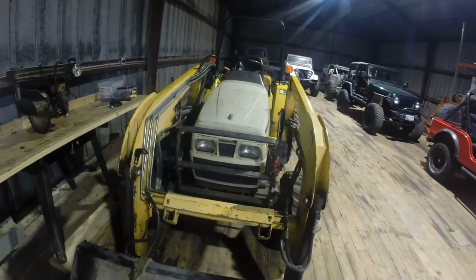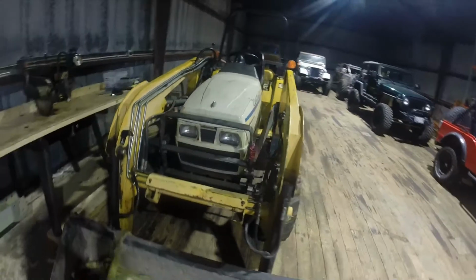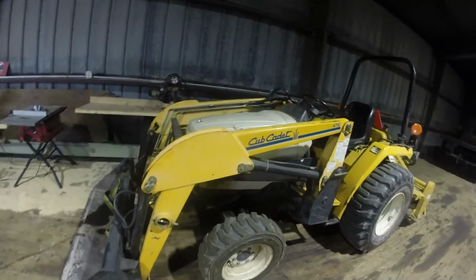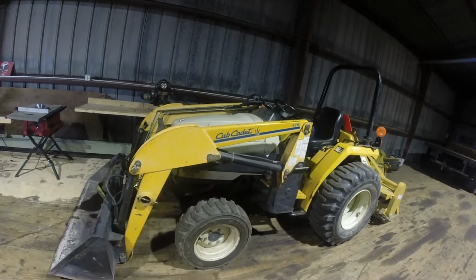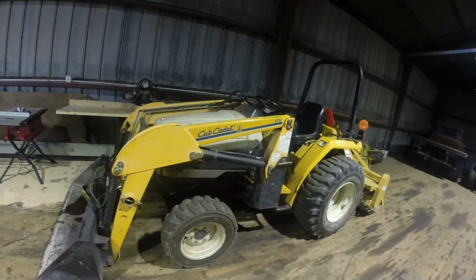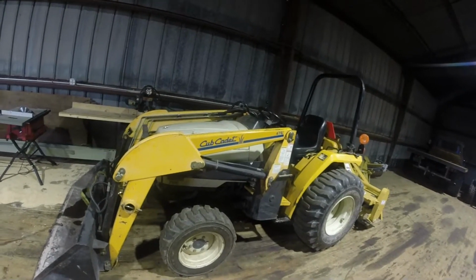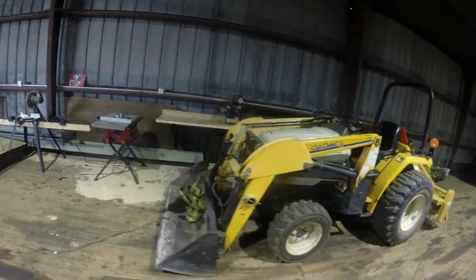So the plan today is get everything switched over, get the new fittings and hoses in, get the thing bled out, and flush everything with the new lines. And then next week, when I've got 10 gallons of Cub Cadet hydraulic fluid coming and 2 filters that I had to order, I'll do a full hydro trans change and probably do the engine oil again this year. So all right, let's drag it over to the shop and get these lines changed out.